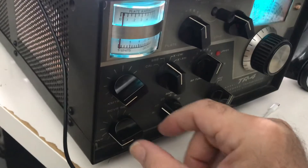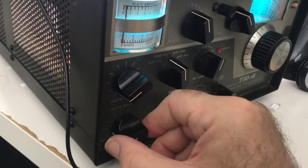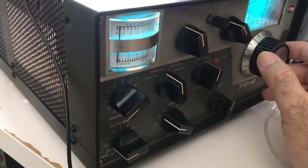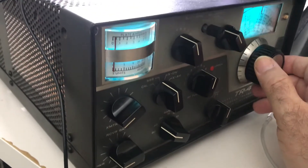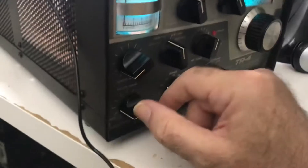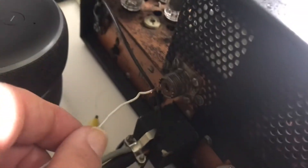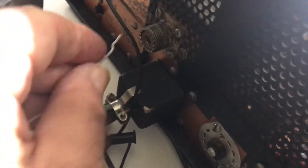You put the phase inverter on top and the balun on the bottom, and they give you some coax to go to your rig. You can't transmit on this, but you can receive. Here's the Drake TR4 on 40 meters — there's a CW contest here in California so I can hear a bit on here. It's not super strong, but what's interesting is when I put in this 140-to-160-foot long wire — a wire running around the outside of the house — it picks up a lot more noise.